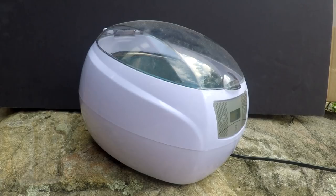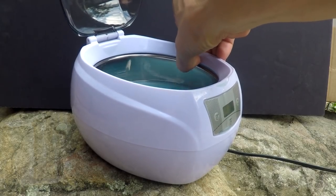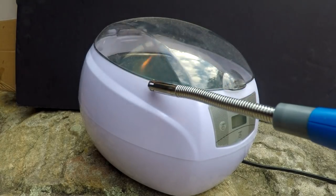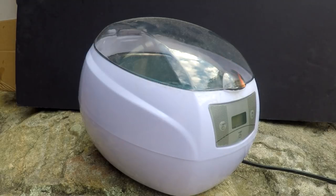Time to put our flammability test in context by introducing the ultrasonic cleaner. For this to work without a naked flame, we're relying on a spark from the electronics within the ultrasonic cleaner. There are two types commonly available cheaply on eBay — one has a removable tray, which I haven't purchased and can't comment on, and the other has a tray that's fixed inside the machine. With my exploration you can see there are no gaps to the inside of the machine — the chamber where the IPA resides is completely sealed from the electronics. This should mean any spark from the electronics is completely isolated and not possible to combust the mixture. I did learn however that if you leave a flame on the lid for long enough, the actual lid will catch on fire — so watch out for that.